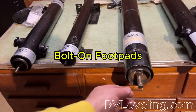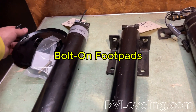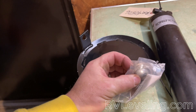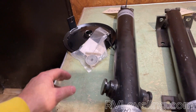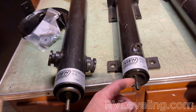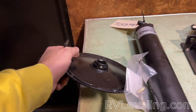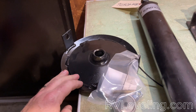The next style, and most common nowadays, has a threaded rod. Similar in function, but you go over the end and there's a ball and socket that comes in a kit that you then fasten with a nut. For replacement, they come in a pack with the foot pad and bolt. Many times these can snap closer to the actual cylinder rod itself, and if you can't back it out, you may have to drill it out. Many of the foot pads do come with those parts included, or you can buy the part kits separately.